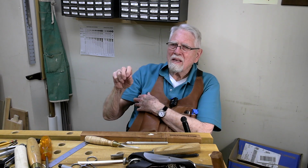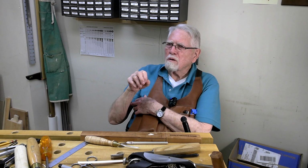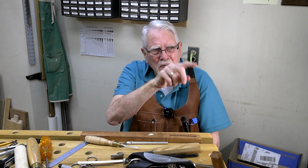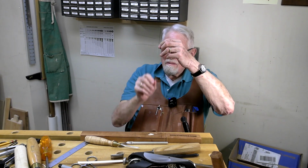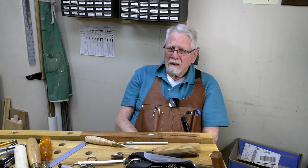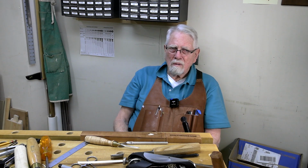And I have their miniature, I have two or three of them, but I have the one that's the shoulder plane. And you know what that's really good for? Well, that table doesn't have legs, but I have a table over my apartment where I have reeded legs. Well, shaping those little tiny reeds for that little mini plane, boy, you clean those up like nothing. Of course, they're pretty good because I made a jig to make those reeds with, a router on the lathe. It really worked good.